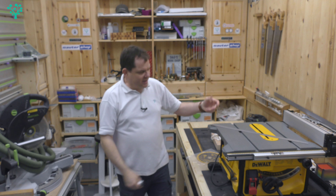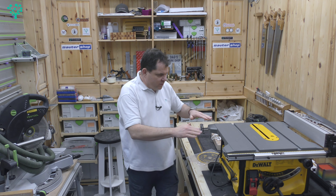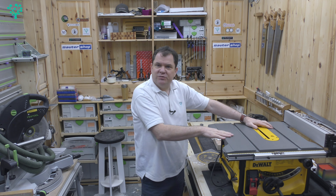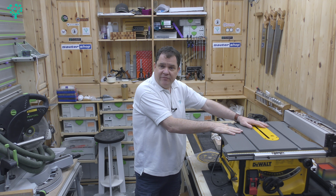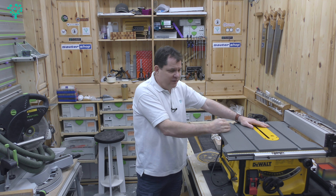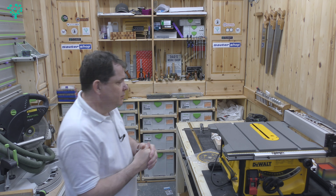That's showing me this table is incredibly flat — no matter which direction or plane I check, I'm getting the same result. Dead flat, not even fractions of a millimetre out of calibration. I'm not sure whether the moulding has changed or been improved, but if you've got a new machine with a flatness issue, get back to the manufacturers.